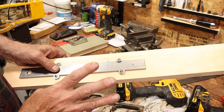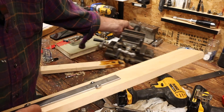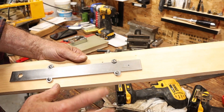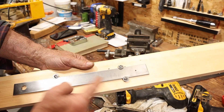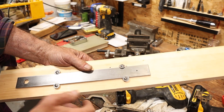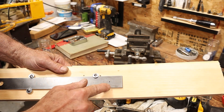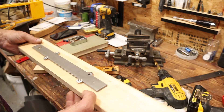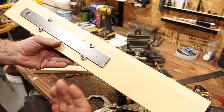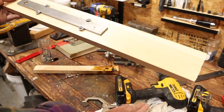Now I'm going to show you the drill press. Instead of using my drill press vise, which would be ideal, I'm going to use this board. I've secured my bar stock to the board with panhead screws and washers, and I'm going to drill my hole right here. I've got a well-defined punch, and I'm going to get this hole directly under the drill bit and clamp this to my drill press table.